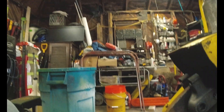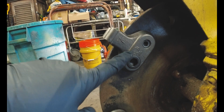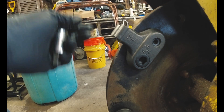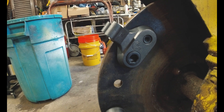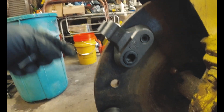After putting all of these teeth on, I noticed that the teeth are set at different depths. I didn't know that, and it didn't come with anything saying that they would be. I also noticed that the wheel itself — the pocket holes for the main bolts — are at different distances from the edge of the wheel. So I'm going to measure those and get all these teeth back off. Thank God I didn't put them all on. I'm going to measure the distance between the holes and the outer edge of the wheel to figure out where we're going to put these.